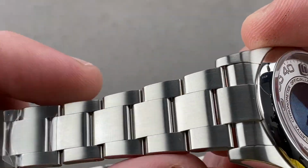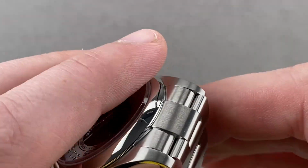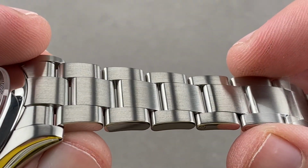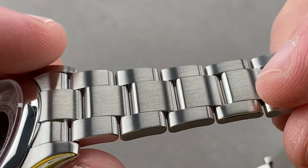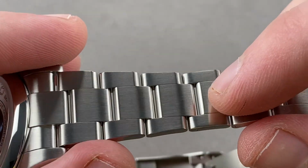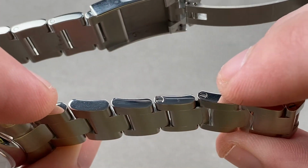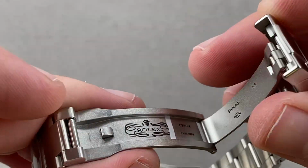the bracelet first. Rolex has its own foundry. It makes its own highly anti-corrosive 904L steel. This steel can be bathed in salt water and then removed without rinsing, whereas conventional 316 generally needs to be rinsed to avoid oxidation. No need here. Top of the Oyster 3-link bracelet satinated. The outer face is polished, removable links fixed by screws. And then we have media blasting inside the clasp.